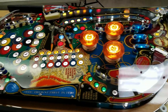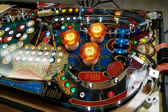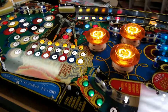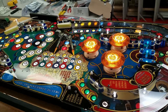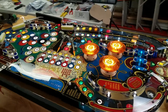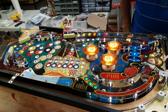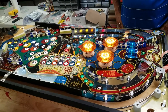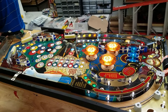We are pretty much done with this play field now as far as I know. We've still got to put the eight ball target in and these drop targets in over here. But underneath the table, we need to reestablish the solenoid expander board connection — the solenoid expansion board drives three additional solenoids on this machine, and that's going to be driven off of our custom board. It's got an SCR on it designed just for driving that solenoid driver board, but it's not hooked up yet, so we'll have to figure out how to get that hooked up and test it.